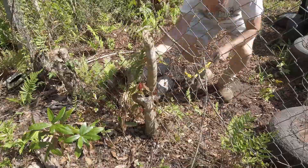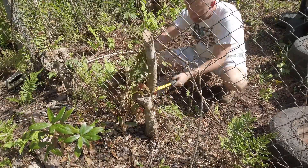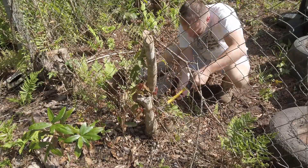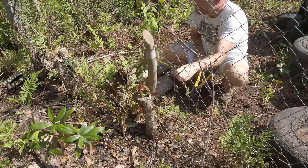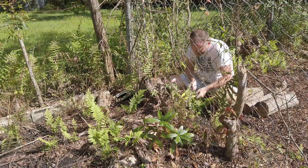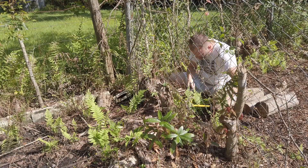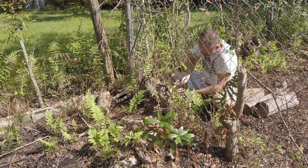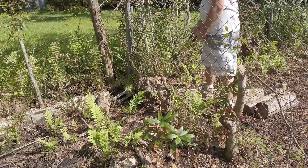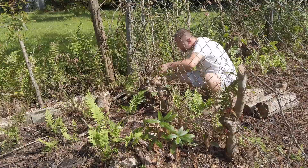While I was babbling on about hard pan, more work outside of the wood chips actually needs to be done in order to prep this site to receive the pad for my new workshop. To put it simply, I've got to remove this chain link fence because there are a couple of tree stumps here that I need to get out, because I'm actually going to cut a swale on the side of my new workshop pad in order to aid drainage.